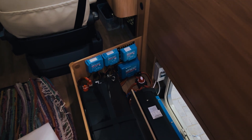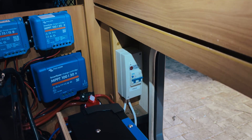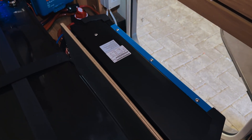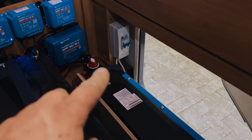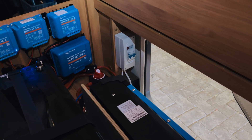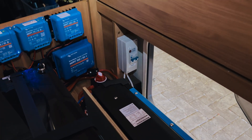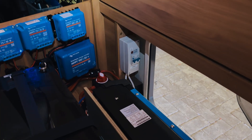So a substantial system. We've also gone in and put in the fridge solar dump option that we offer. That allows us to use the second AC output of the MultiPlus 2 to power the fridge when there's surplus energy. This one we've got set to come on when the batteries are at 95% and to turn off when they're at 70%, so there's a bit of a window where if there is excess solar, it can run the fridge for a good while.